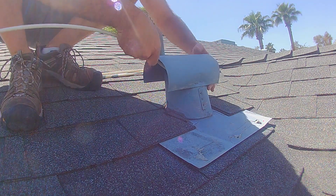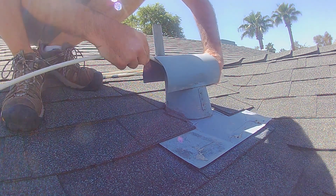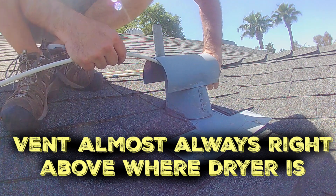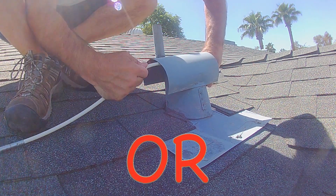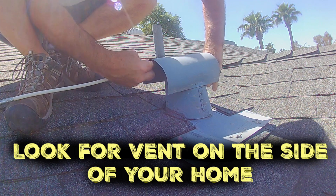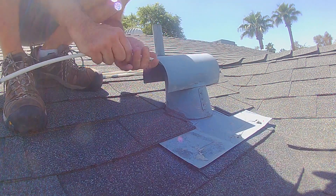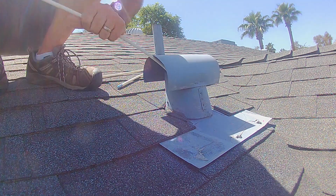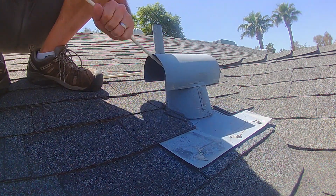Here I am trying to manipulate this brush around a little bit of a 90-degree corner. It takes some persuasion, but it does go, and then I just start adding extensions to that rod to get it as far as I can. Make sure those extensions are screwed on tight.